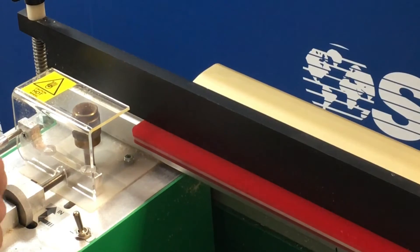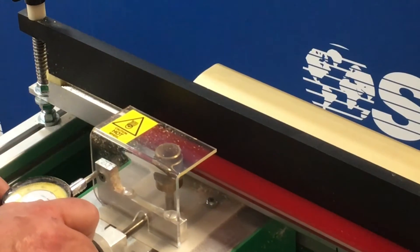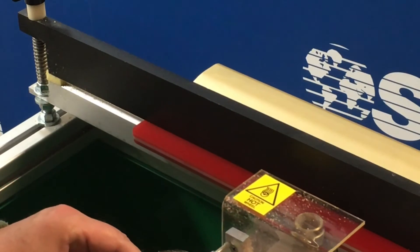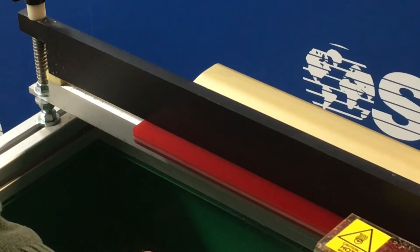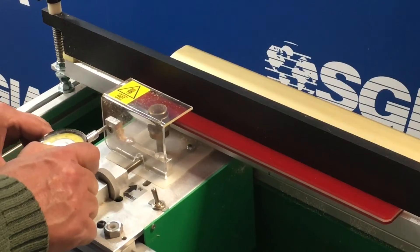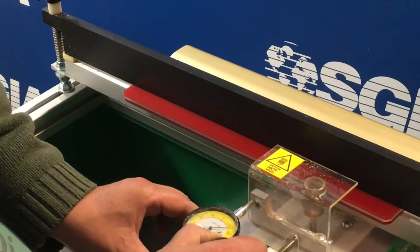One of the key things to keep in mind when you're sharpening squeegees is to gently move the grind wheel against the rubber in small increments. You don't want to move the grind wheel too close too quickly, so it's best to take small shavings off for each pass versus trying to take it all off in a shorter number of passes.